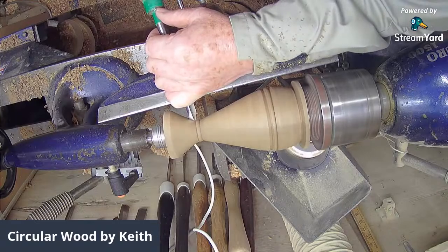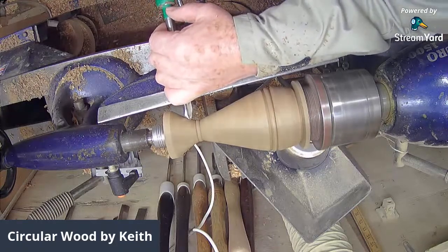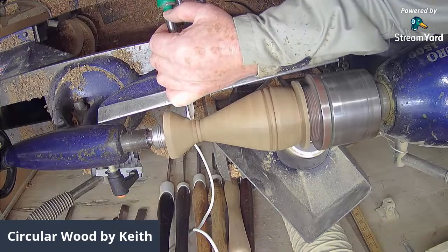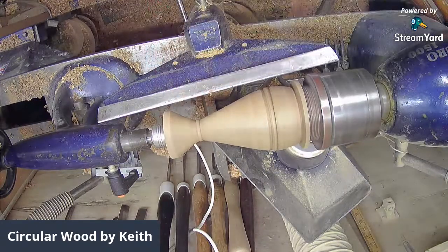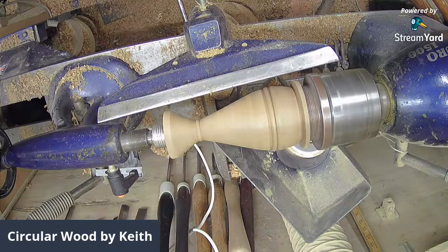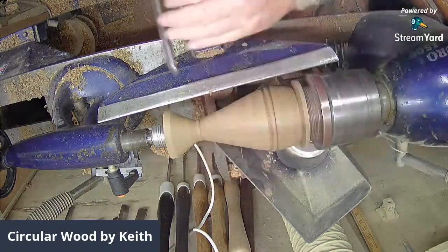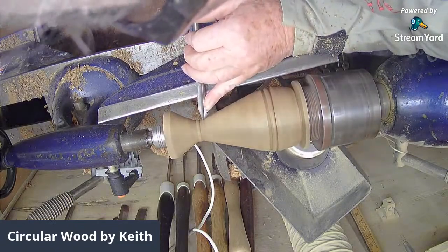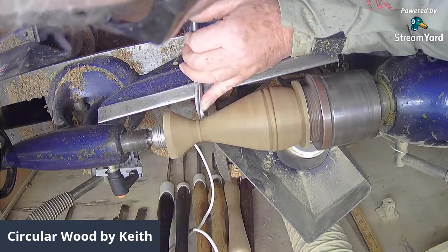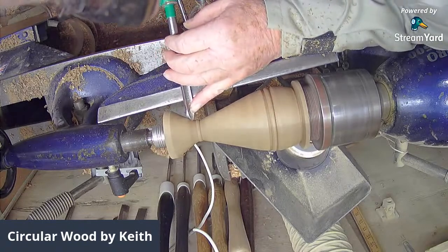What finish can I use with intrinsics? They are a water-based paint. So once you put a sanding sealer over the top of them, any finish you want. But you don't really want to use a melamine sanding sealer. You need to use a spirit-based one. Yes, you want a cellulose, spirit or cellulose, so you can get a good shine. You can use oil over the intrinsic colours as well. Yeah, Danish oil. Almost anything, because they're basically water based.